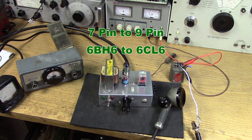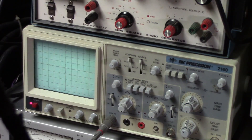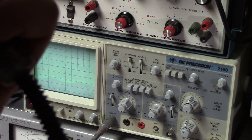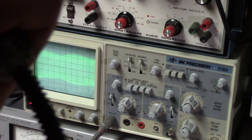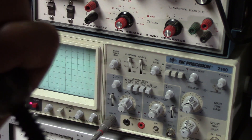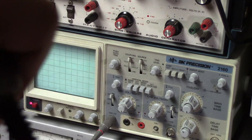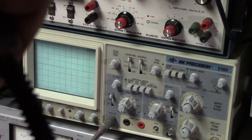This is interesting, right? So if I have this wired correctly I should be able to turn this on and that tube will light. Now we have the other tube installed - hello - and you can see I'm easily hitting 100%, I'm actually over-modulating. One two, hello, one two. So there's no doubt this tube modulates better than the other one. It's not putting out the power because it's way up in the air on the adapter, but it is a better tube for suppressor grid modulation, even with this old microphone. We are at least getting modulation.